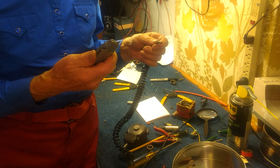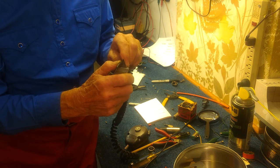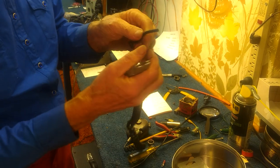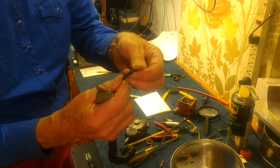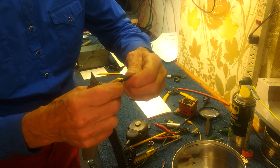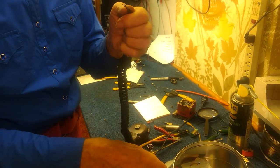Find your Stanley knife and cut about three-quarters of an inch through the black rubber outside of your mic cord. Check to see if you have done it without cutting into any of the wires. There may be a little part not done yet - carefully cut that rubber and make sure you can see what is going on inside. Then pull that rubber jacket off.